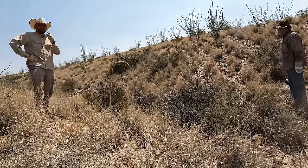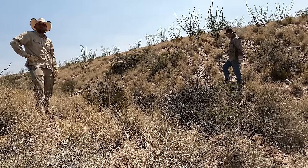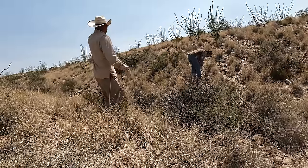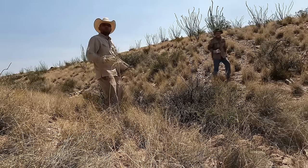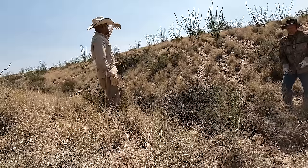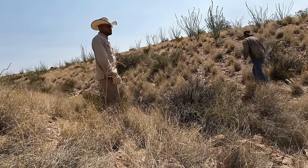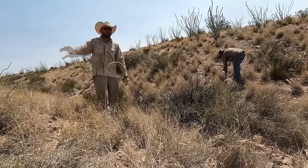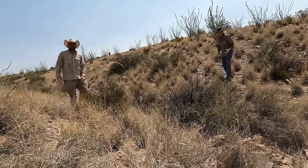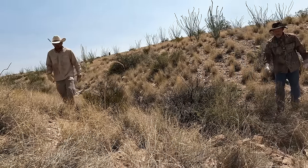I'm changing the strategy. I talked to an ecological restoration specialist, and he said this angle here is actually perfect for terracing — basically building stair steps. On this hill, this part's a little too steep. I can just get a bulldozer and knock it all to the side. I don't want to do it all in one fell swoop because I don't want horrible erosion. If I start on the top and that holds in a heavy rain, do the next layer — section by section from the top of the hill. That goes so much faster than the bathtubs. The bathtubs took three and a half days for two acres using an excavator, but a bulldozer should easily get an acre a day.